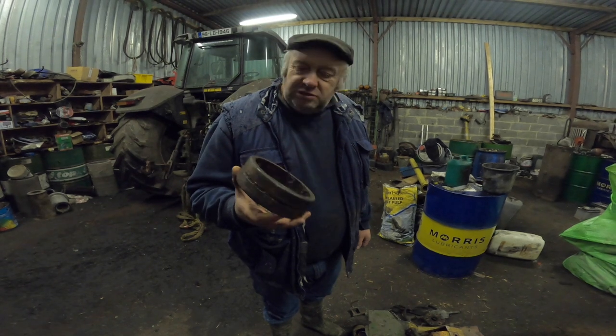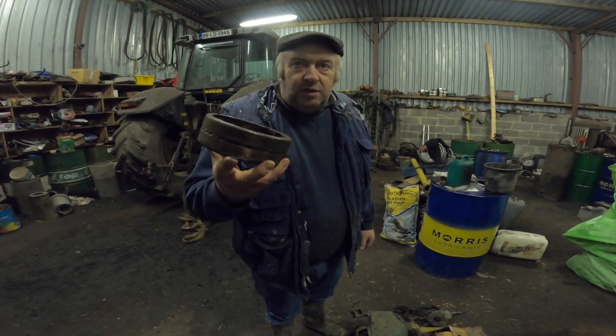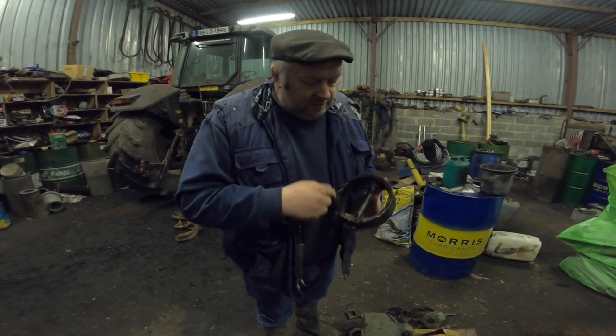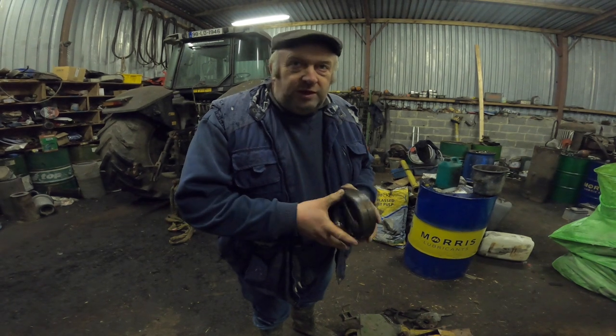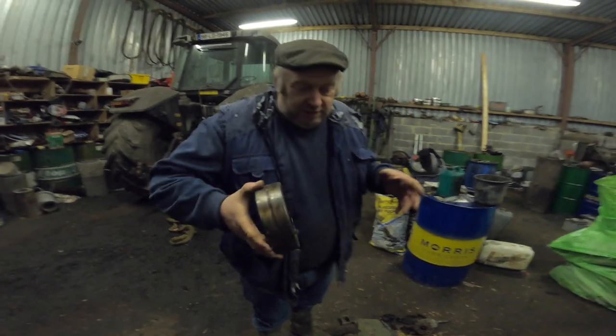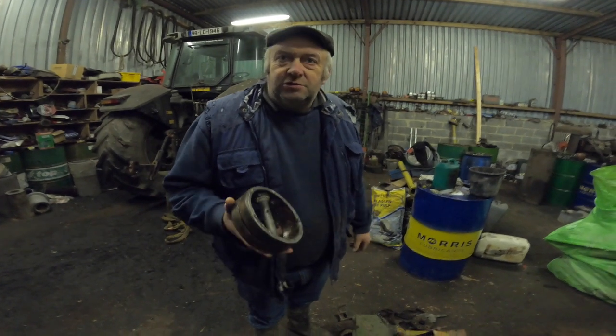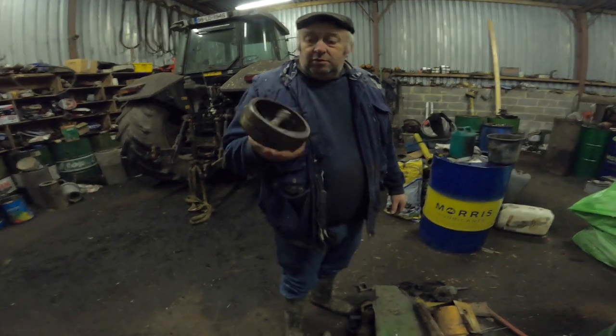I'm not 100% sure, but I think they're nearly €500 a piece, the bearings. They're the same as what's in the crushers in the quarries. Yeah. And the double race balls is unreal. You have to put them in an oven and heat them for an hour and a half before you can sweat them onto the rollers. Tricky operation, but we did four of them in that crimper.